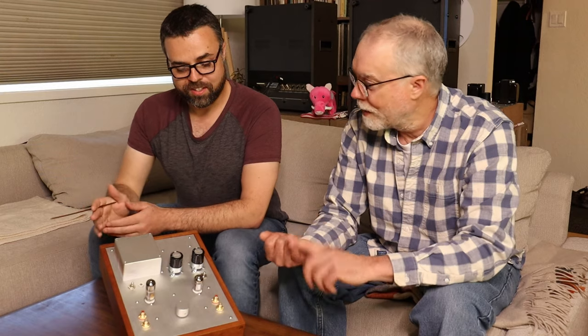But in this voltage gain stage, we can run probably 6 or 7 different tubes, and they're all biased in a really nice area. Let's see if we can remember some of them. 6CG7, 6GU7, 6BZ7, 6BQ7, 6N6P, 6N1P, 6DJ8, 6922, 7308. I'm cheating a little bit because those last two are all 6DJ8s. And the 6N23P. So all of these will run in this amp.